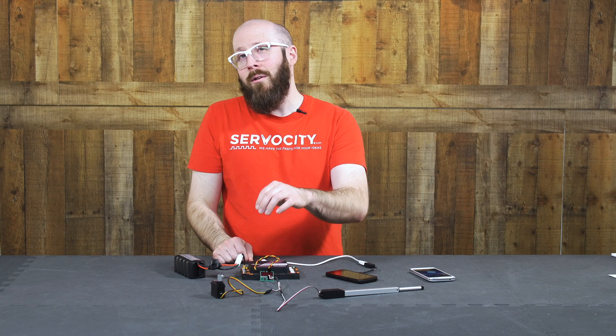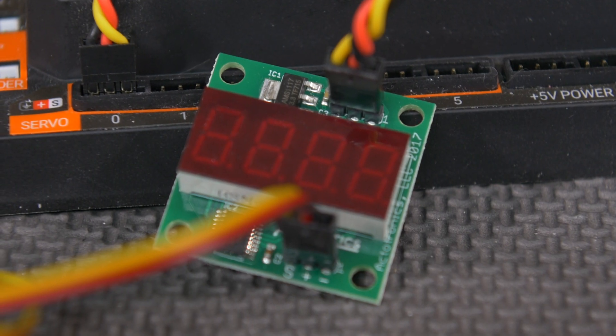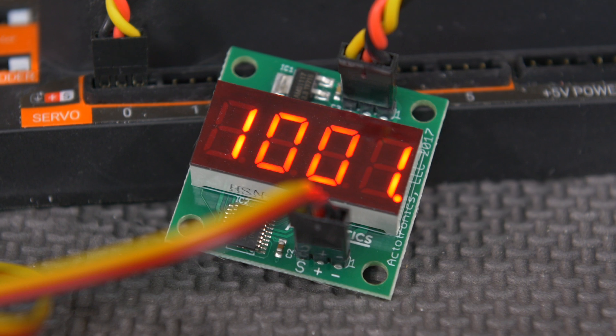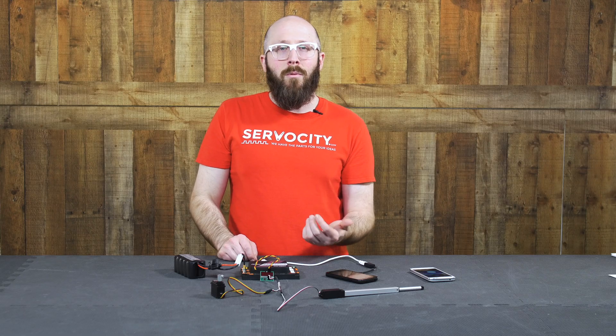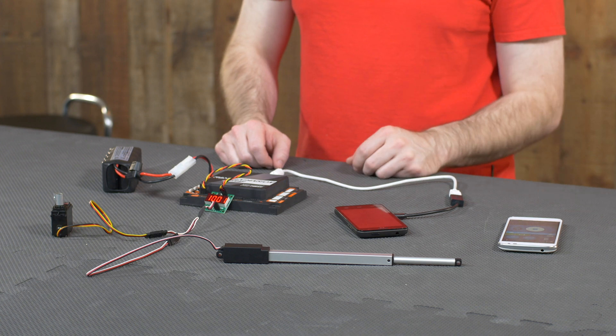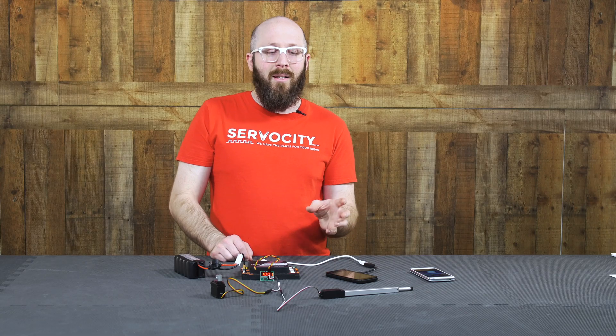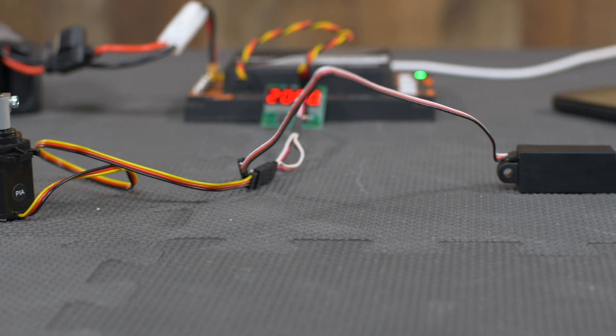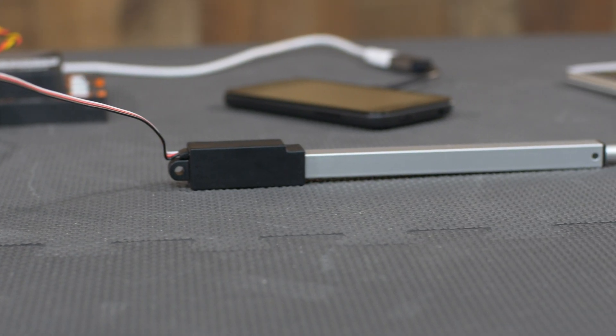While the PWM meter is not legal in your final robot, it is a great tool — just like a multimeter — able to read that PWM signal and give you a simple readout. So let's go ahead and run that code. You'll see the linear servo and the rotational servo both operating off of that same PWM signal.